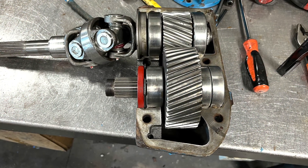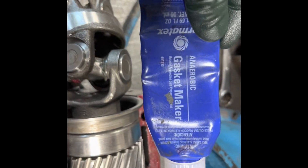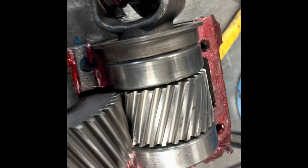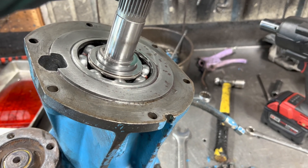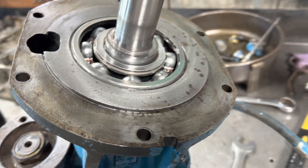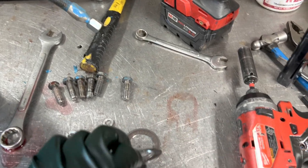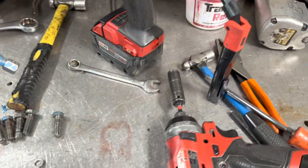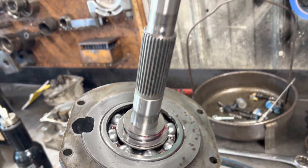I've got the Permatex anaerobic sealer I use here, part number 57513. I just dab it around with my finger, make sure all the corners are covered, and we'll put the halves together. We've got our V-Drive all together - feels pretty good. Those grease fittings aren't hitting anything. Got just the right amount of preload and backlash in it. Next thing is the needle bearing and race - needle bearing goes down, a little jelly on there, bearing first, washer next, race - and that's ready to install to the transmission.